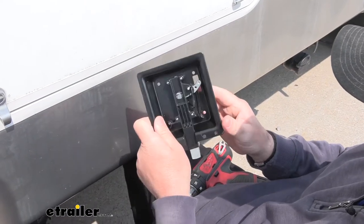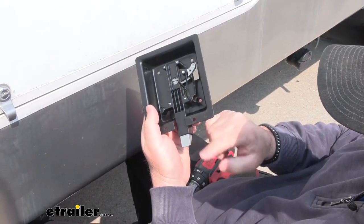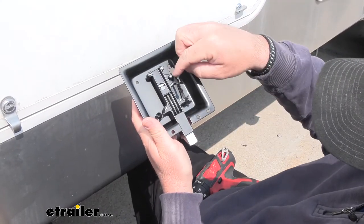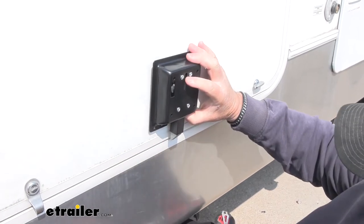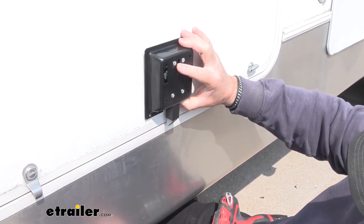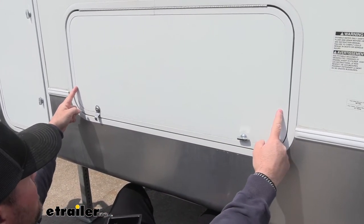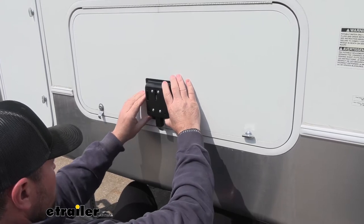To start your installation, what I like to do is take the parts out. You're going to take this base, which is actually mounted on the inside of the door — this part here is on a spring, so it's going to stick out farther. You'll notice there's a little line there. I like to push that back all the way up on the line so that when the whole thing is put together, that's where it's going to be. Put a little zip tie around it. What we don't want is for this to be down too far, so I'm going to use this as my template. I'll pull this up to where this edge is right at the bottom of the door, then I want to measure between here and here and find the center. Put a little mark there and get this as centered as possible.